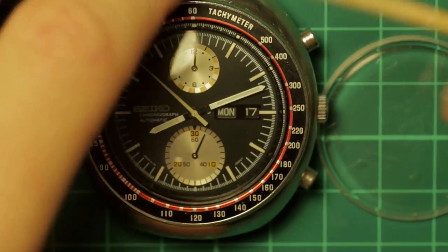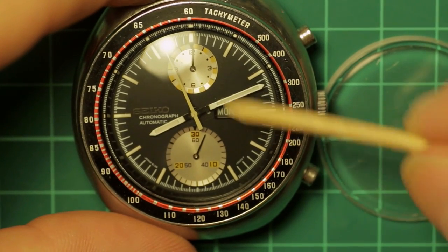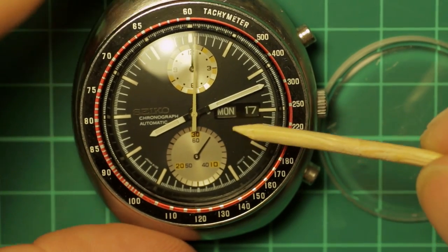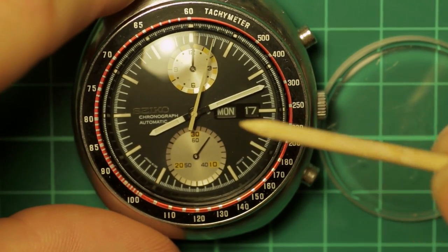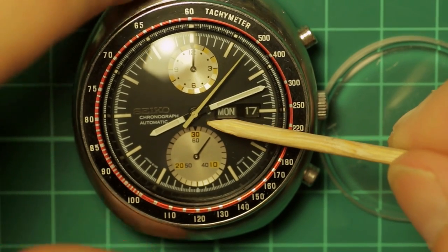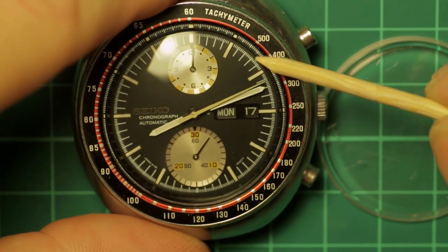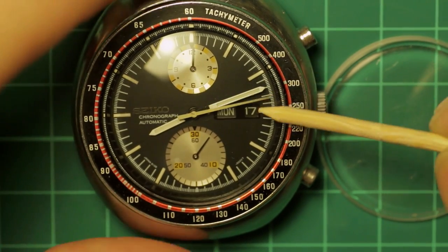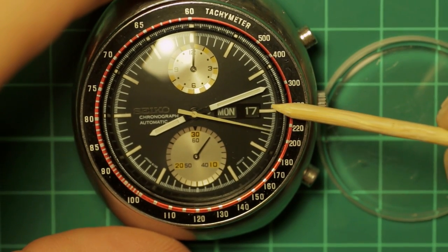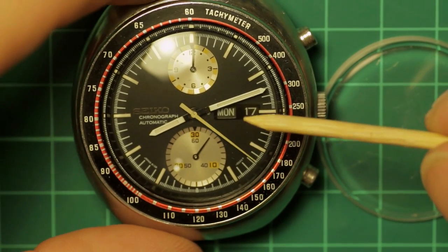That aside, it's in really, really nice condition. Other than a little bit of excess oil on the automatic winding parts, they were over-oiled a little bit. Everything else looks really good. It looks really clean inside. The dial side was really, really clean, as you saw in the strip down and rebuild. And the top side with all the chrono components, again, looks really clean. Maybe a little bit of excess grease on a couple of the chronograph parts,